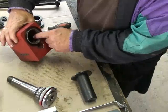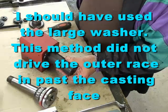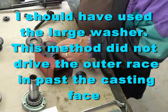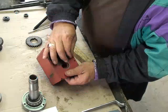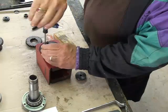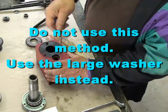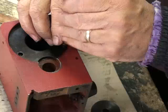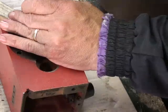I'm now going to put the matching part of the bearing into the casing. Then I'm going to use this tube and try to pull it in with one of these pullers. I found that if I put the flange in that way and knock the bearing in gently far enough, I can then finish the job by putting the three screws in here and just gently screwing that plate down. It's going down quite well. These are the original screws that hold the cover on — a little housing. That's all it needed. Quite simple.